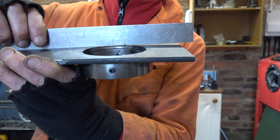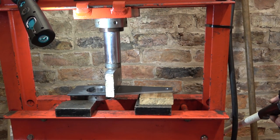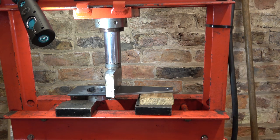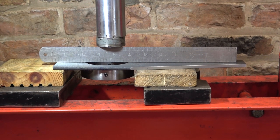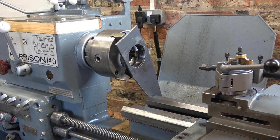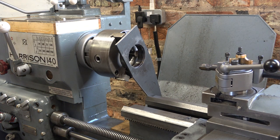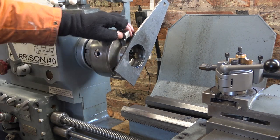Rather predictably it's like a banana — I've got to straighten that out now. After quite a bit of work that's okay, though it'll only bend again when I weld the brackets on. Now it's flat, I tried it on the drill and that boss has warped more than I'd allowed for — it's tight on the quill. So I'm going to have to machine it out, but I can do that in the chuck if I do it before I weld the ribs on, because when I take the block out this plate just clears. Woohoo — aren't I lucky!